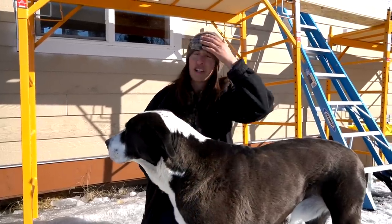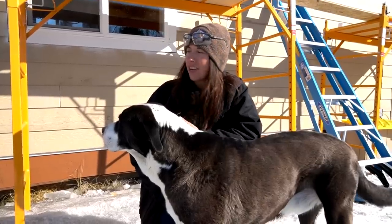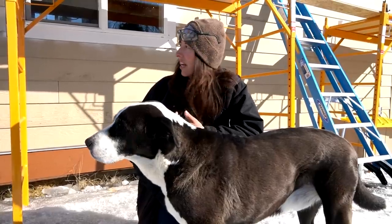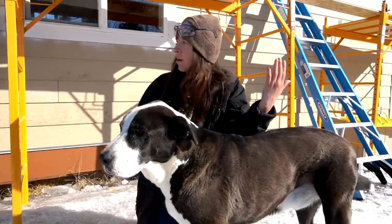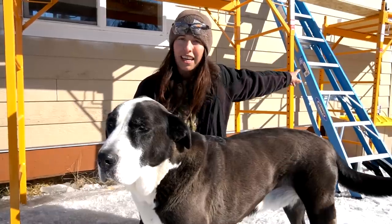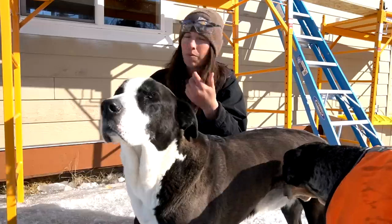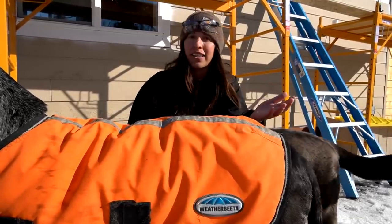We're finally about to head up on the scaffolding. I wish I could say today has gone better, but it's actually been a nightmare — this side of the house was just a lot more challenging. I wanted to point out how we're doing the seams where two pieces meet up — we're trying to stagger them. The sections come in 16-foot lengths but this is a 20-foot wall, so we have to stagger them, which you want anyway. We're making sure to leave the 3/16ths of an inch gaps, and it's looking pretty good. The gecko gauges are working great — I don't know how we'd get this job done without those.